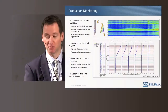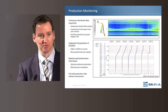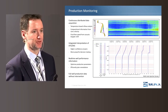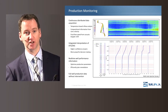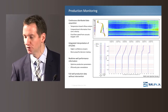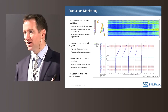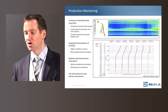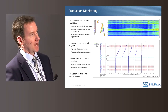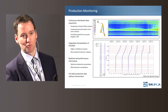This section is related to production monitoring. Temperature has long been a core measurement in production monitoring, but when it's complemented by the unique attributes of true acoustic data, the combined answers become a lot more robust. Distributed acoustic sensing gives you an array of acoustic sensors in the well that you can record from continuously. The image at the top right gives an idea of that time-wise temperature and acoustic recording across the entire well path.